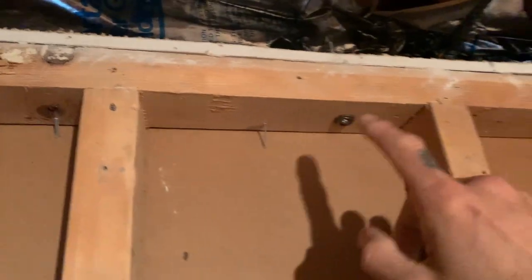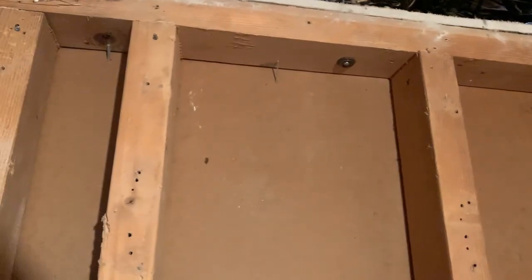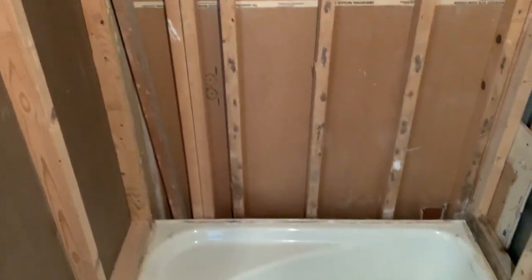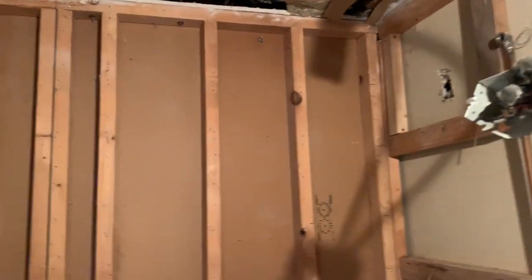Quick, easy fix. Up here, this bathroom was an extension. So if you see, they just have a through, kind of a butterfly wing nut action going, I forget the name of them. But that's what's holding the wall. I think there's one there too. What is it? No, it's a knot and nail. Anyhow, so they have one keeping this wall straight, minus or including all the crown molding or whatever, that will help a little bit. But that's not adequate, so we're gonna put blocks in here, probably three of them, and then screw right up to the blocks to really reinforce that wall, because it's gonna be holding 200 pounds of tile and mortar, thin set. So it needs to hold it up without popping seams down in the future.